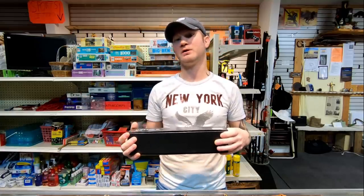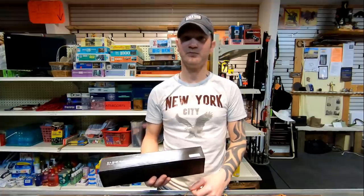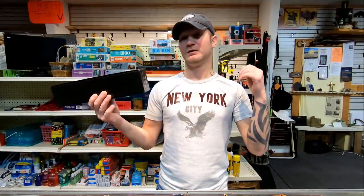Now, why that's important, say for example, you're going to build a skyscraper. If you were to use solid pieces of metal, compared to a similar sized I-beam, they're going to be heavier, harder to work with, and you're going to add a couple hundred tons to your overall design. So by making this an I-beam, you make it lighter and you make it cheaper.